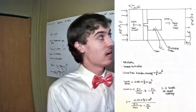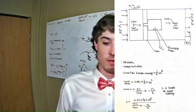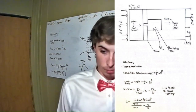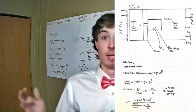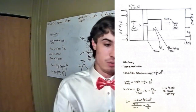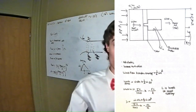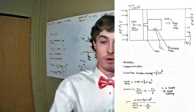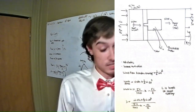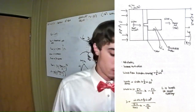But initially, I can make me a table. So that will account for friction and the inefficiency of the motor. And so what I can then do is put any rotor onto the machine and then subtract the two. The power that I'm getting with the rotor minus the power I'm getting without the rotor at the same RPMs and other conditions will get me the power going into the rotor itself, because that's all I care about. I want to eliminate all other factors other than that rotor.